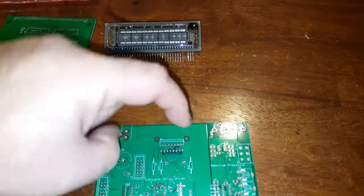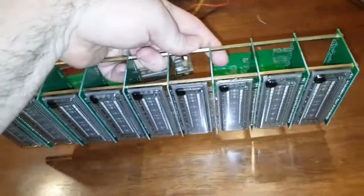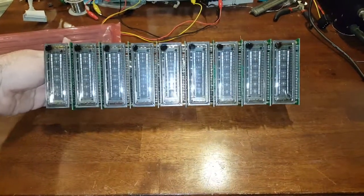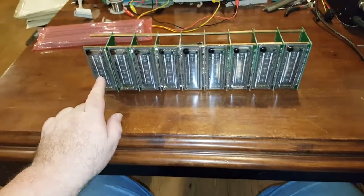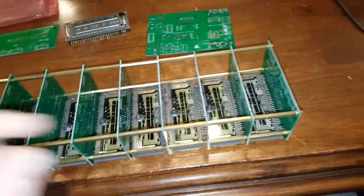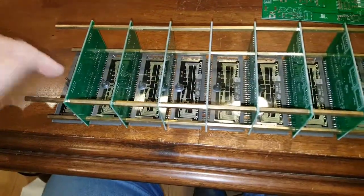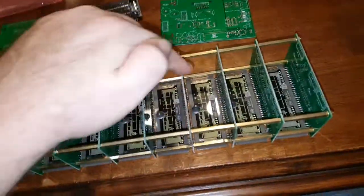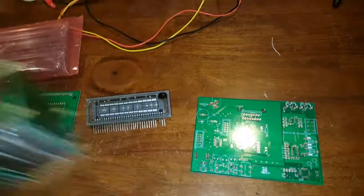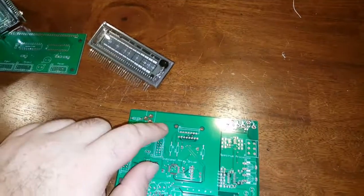This chip with a heat sink on it is big enough to handle the current across the entire array. Once you assemble all these boards together, this is what you end up with — isn't that cool? There's your spectrum analyzer that's going to fit in the enclosure. I can turn the center indicators on or off and just leave the bars. The boards are daisy-chained with little ribbon pin connectors all the way across, and power is jumpered down the line and eventually plugs into the main board.